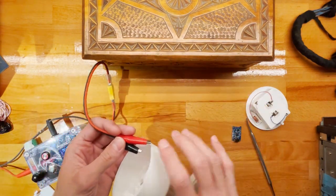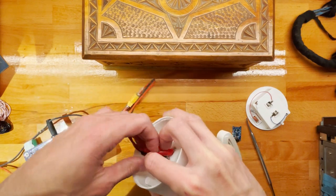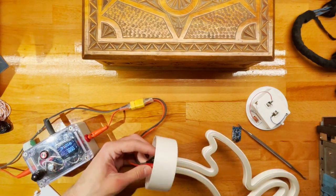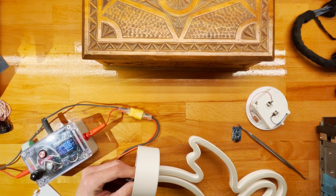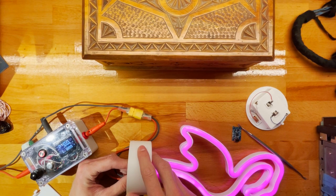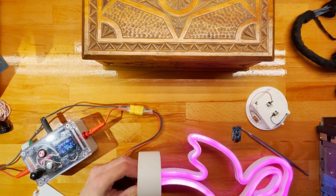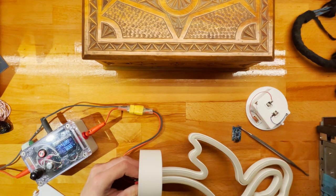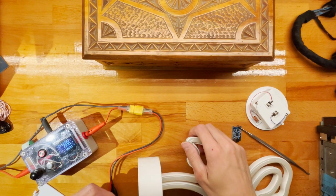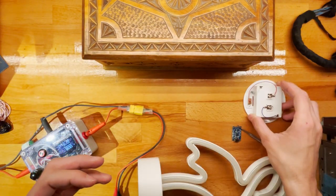Well, being this purple, I'm assuming these LEDs are white. Well, actually, blue LEDs exciting some phosphor, so it should have a pretty high forward voltage. So let's see it. I think we do need the resistor. All right. One watt. Yeah, but we are current limiting, so let's see how aggressive that goes. No, this is too bright. Yeah, it's too bright. Okay, so I can't read resistors, so I don't know what this is, but I think we'll keep it.